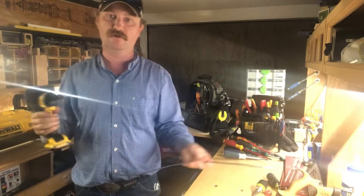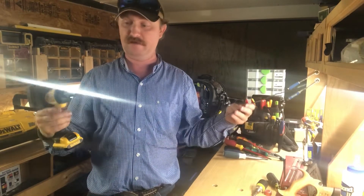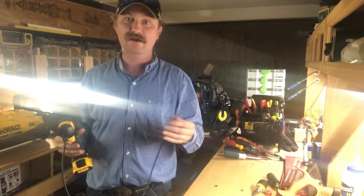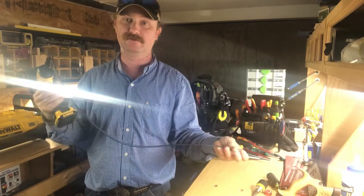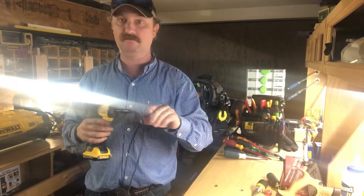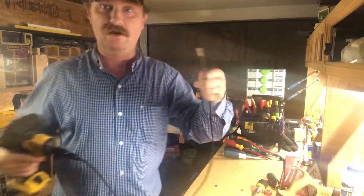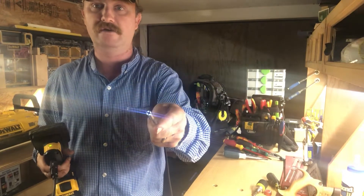It's a waterproof camera, so you can go right down into a pipe. I've used it in water before — pretty much the whole cable works fine as long as you don't have completely black water. Just looking through normal drains, if you need to look down a sink to see if it's hair or bolts in there, you can. You pull a P-trap, clean it out, and if it's still plugged up, stick this in the wall and see if the blockage is right there.